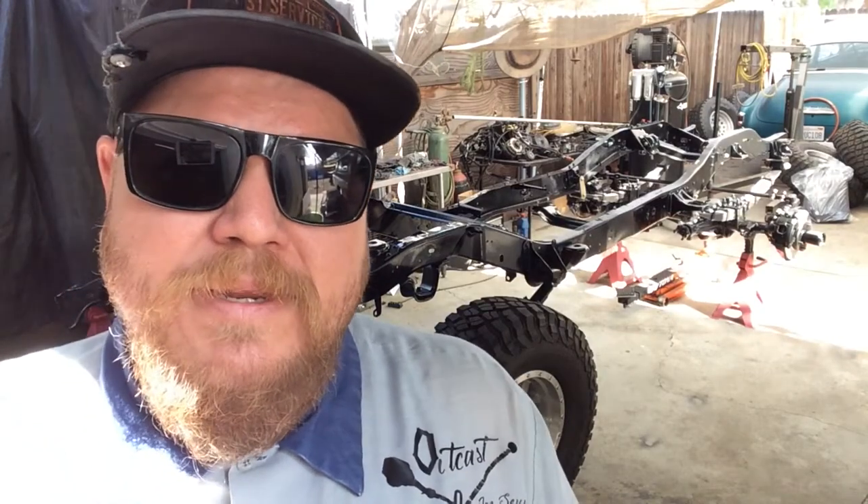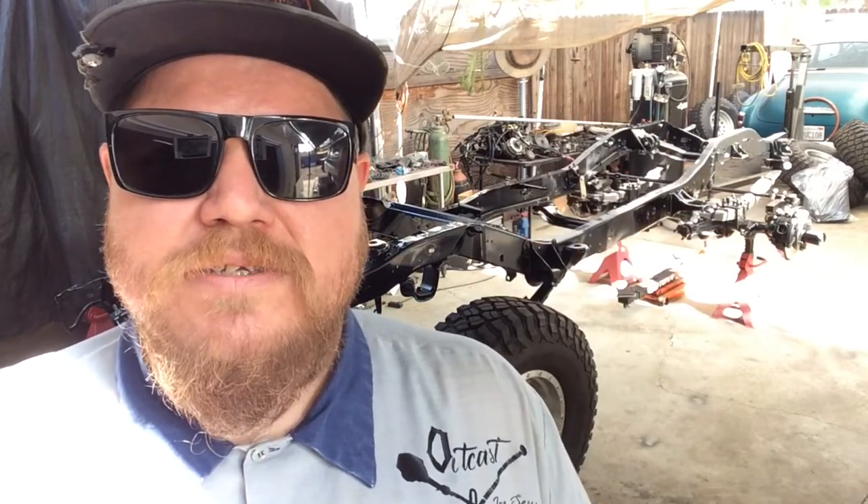I get it — it is a little sketchy. I wear a face shield, safety glasses, and gloves when I'm running these, and I've had really good luck with them. As long as you're wearing all your PPE and you're not forcing your grinder — there's definitely a direction you want to run your grinder depending on which way you're cutting, and it'll make your life a lot easier. It won't get that bite and grab that so many people hate. I don't personally love four and a half inch grinders, but a lot of times you can't run a plasma cutter or torch, so you're limited.